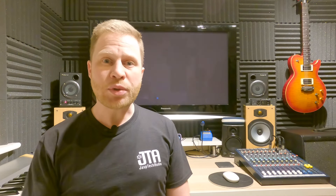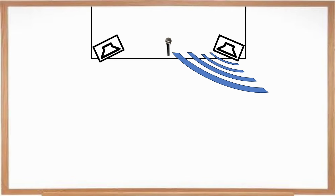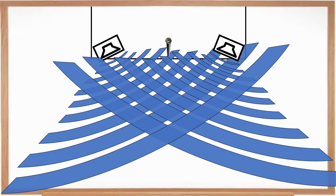If you want to be able to hear yourself on stage you need to get a monitor, which is a shaped speaker that goes on the floor and aims at you so you can hear yourself. We are going to look at monitors in a future video — what they are, how to plug them in and how to set them up. We also want to make sure that we're not angling our speakers in, because the dispersion angle — the angle in which our speakers project sound — may be projecting some of that sound back towards the microphone and therefore creating feedback problems.